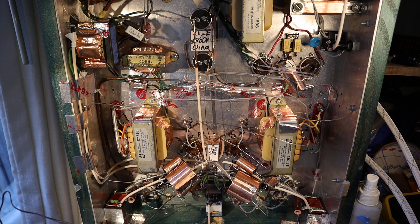I used a 560 ohm, 2-watt carbon film CoA resistor for the input tube's cathode resistor. That gives me 2.6 volts on the cathode for one channel and 2.9 volts on the other. I'm still using 20-year-old tubes that served 20 years of service in this amplifier and they're still pretty good. One is stronger than the other, but that's real life. You can get voltages that are a little off — if somewhere it says 2.5 volts bias, you'll get more or less. Don't worry about that. If you get something wildly different, like 5, 7, or 1.2 instead of 2.5, then something is really wrong and it's not just an aging tube.